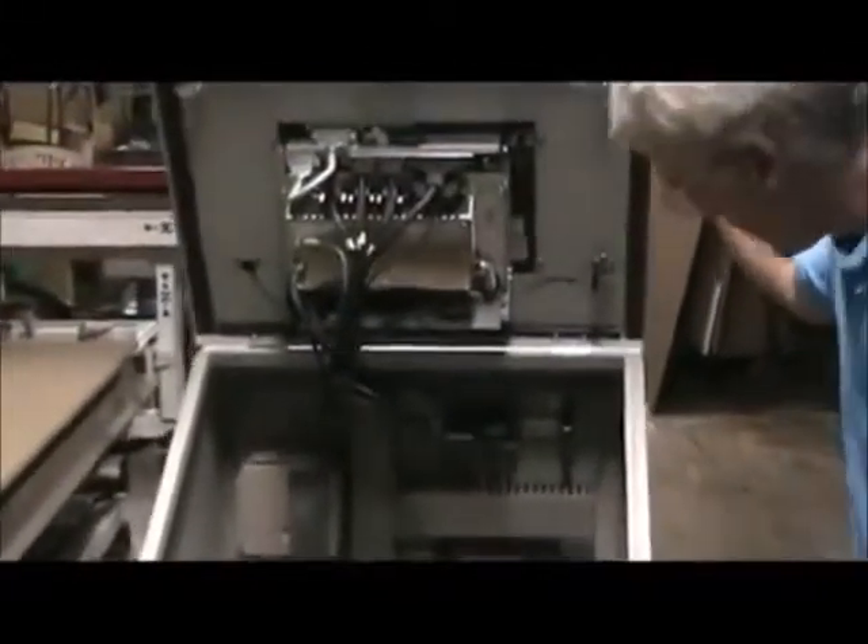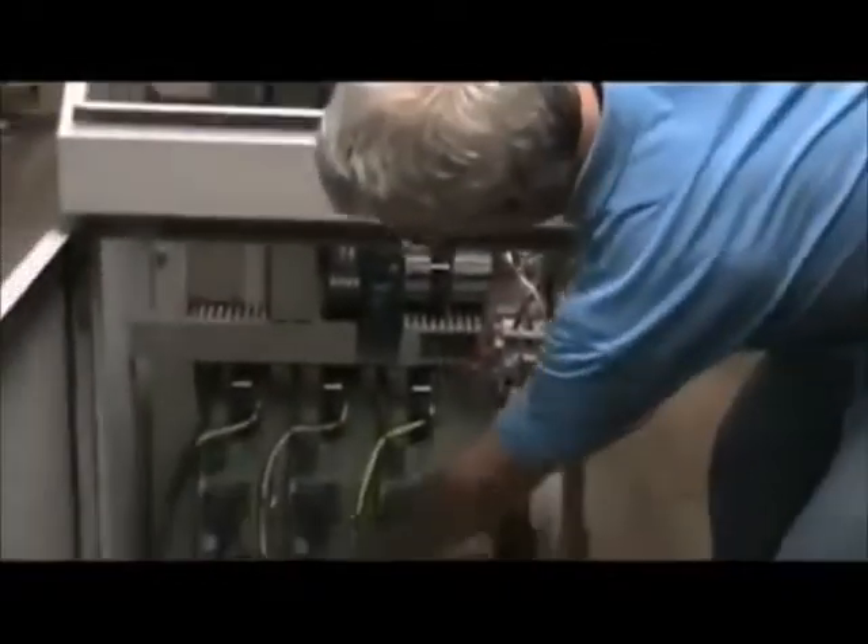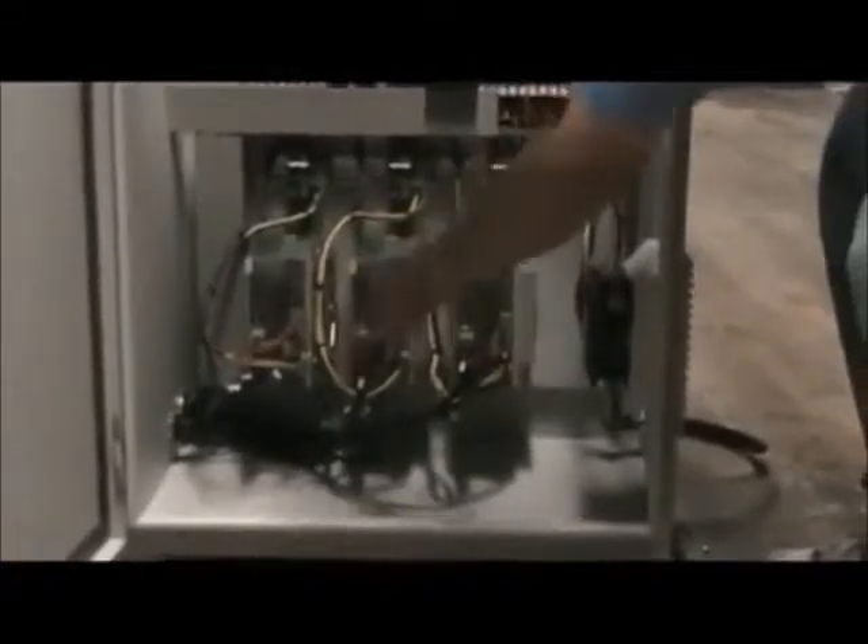Can we get a look inside? We are getting a look inside that controller. Bill, you want to tell me what's going on in here? Really nice clean box design here. We've got the Fagor AC servo amplifiers — these are matched to the drives. Very nice wiring in here, disconnect, our frequency inverter, and of course this is the control panel and the control brains right here. Very nice clean panel inside — what you would expect from a much more expensive machine tool.